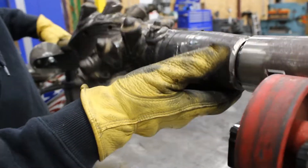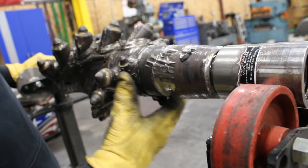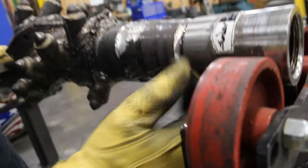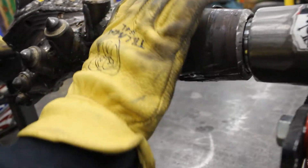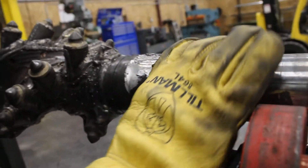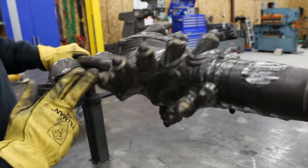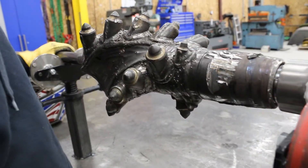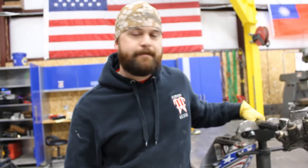But they put it in their machine and bit down on this and you can see that it was not budging. He wanted me to screw this in and weld this out, gouge this out and weld it out. And then I've got to hard face it and I've got to add four teeth in line with the existing teeth. So there's quite a bit of work here to do. We're gonna get preheating it and get rolling.